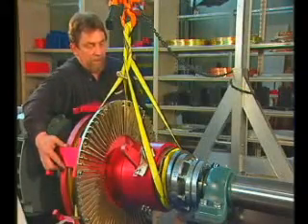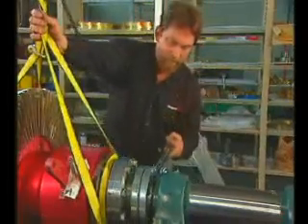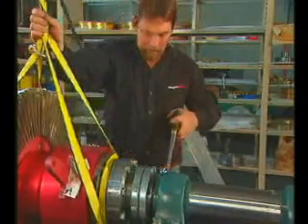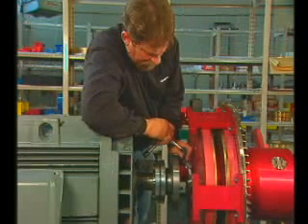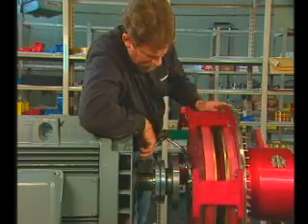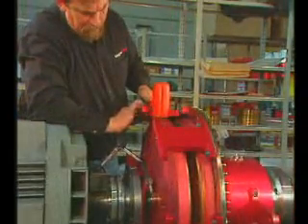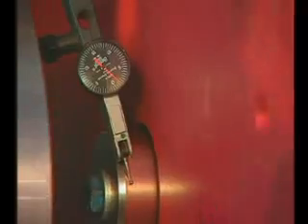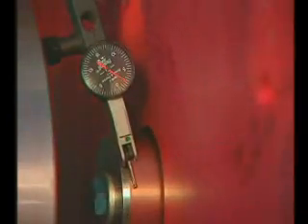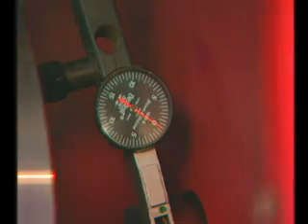Using the proper lifting gear, place the magnet rotor flange onto the load shaft hub flange. Using thread-locking compound on the bolts, torque the hub bolts to the specified torque using a criss-cross tightening pattern. It is essential to place the dial indicator on the end of the center shaft to measure total indicated runout. While rotating the magnet rotor, identify the highest total indicated runout reading. Using a soft-face mallet, tap on the top of the magnet rotor to adjust the shaft runout to less than two thousandths of an inch for 1800 RPM applications, and less than one thousandth of an inch for 3600 RPM applications. The closer this reading is to zero, the less potential vibration there will be due to runout.